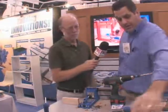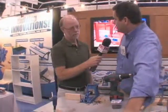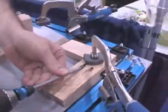Then all you do is you bring it over, you clamp it down with some type of clamping mechanism — a Kreg jig clamp system. We have right-angle clamps. You drill your pocket hole screws. If you want to put a bead of glue in there you're more than welcome to. But you come out with a perfectly flush joint. And what's nice about this is you don't have to wait for the glue to dry — you can just keep finishing your project as you go.